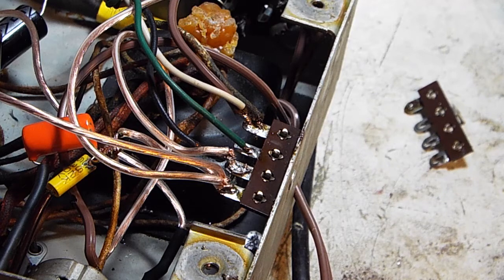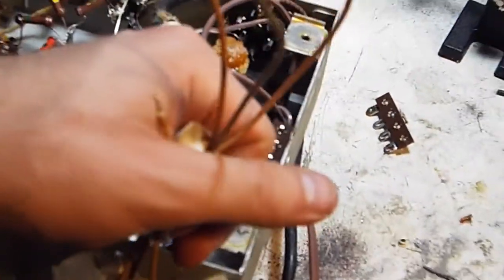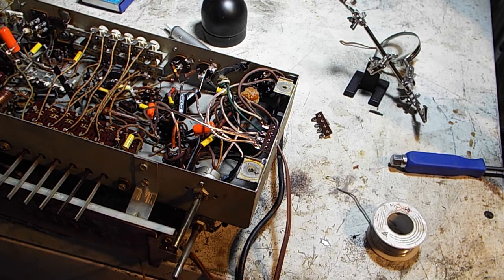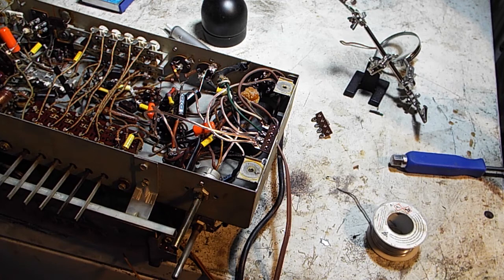I'm also going to bring down the antenna. I chopped the antenna. Hold on, let me zoom out here. I chopped these antenna leads off, because this didn't look like it was a pin connector back here, but it is. So I did chop those. I'll just bring that down and resolder them. It needed resoldering anyway, so I'll just redo those. These wires don't look too bad. They're actually flexible. They're not snapping when I move them. Some of the stuff in here was, so that's why that got replaced. But that'll be re-soldered. My test speaker will be connected onto the speaker.